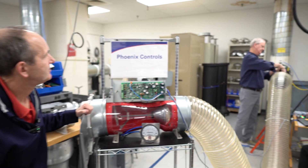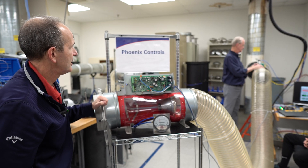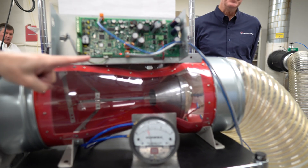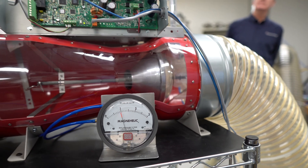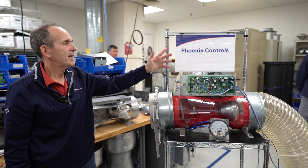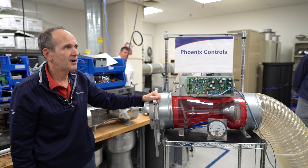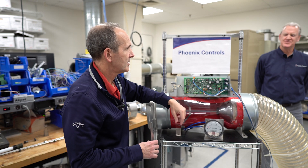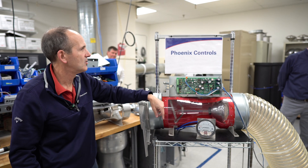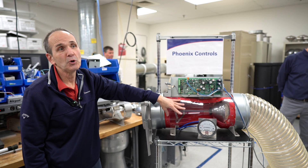You can throw a few in there. We've got some caught in there, and that's probably fine for now. You can see he threw in a bunch of things — there are three or four at the front of the valve, blocking all the way over there. All of those things are blocking, but there's no change in performance of the valve or the airflow. If you go up to 800 CFM, watch the actuator — it's already there. We do lose a little performance because I cut a chunk of the valve out, but minor detail — just be aware it doesn't work as well when you have a hole in it.